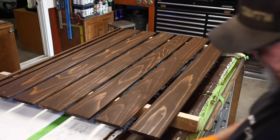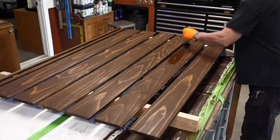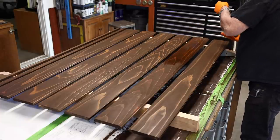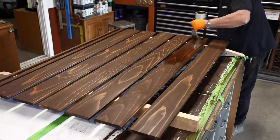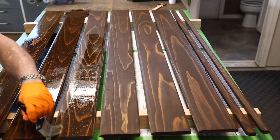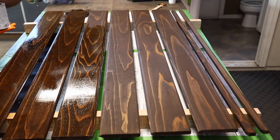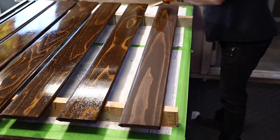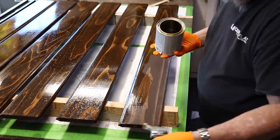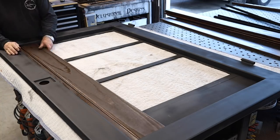So there's the wood — all stained, dried up really nice. The next thing I'm going to do is apply some very thin oil-base polyurethane. This is a semi-gloss finish. The client was not looking for a glossy finish and didn't want flat — they wanted something with a little sheen to it. Once you apply that polyurethane, it enhances the grain and enhances the look of the wood. A good solid coat front and back of this polyurethane — that's all it really needed. Now it's time for installing.